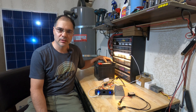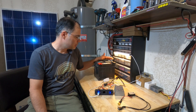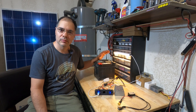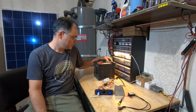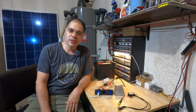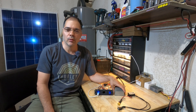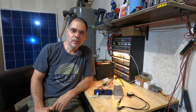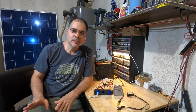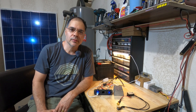Always be careful when using lead acid batteries, especially unsealed ones — I would never use them indoors or for any serious solar project. They're great for outdoor use in an isolated area where they can be safely used. There are much better choices like lithium iron phosphate. Remember that not all buck converters are built the same — I had to have this one custom built to get it to do what I wanted. I hope this video has gotten you thinking about how to build smaller solar systems for small 12 volt projects without spending a lot of money. Thanks for watching.